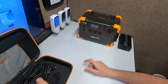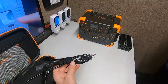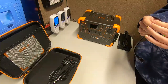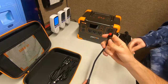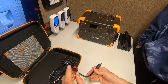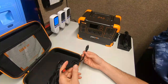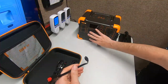Safety tip — let me set that aside. Here's the cable — that goes on here, and then you have others. I'll let Mrs. Rambling Bob explain what they are. She correctly identifies the solar input port. Good job! This is called an Anderson Power Pole — it's a 15-amp charging cord for solar panels. I prefer other connector types. This is your five-pin aviation port which connects to the solar panel via Anderson Power Pole — up to 15 amps or 400 watts max, 32 to 95 volts.